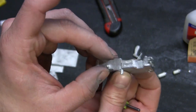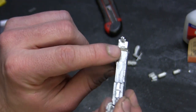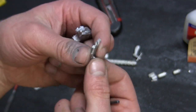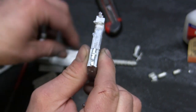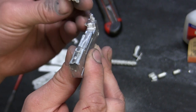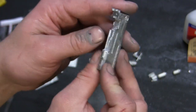You see, with the way the Armorpax kit is designed, because of the way it's molded, the hinge section here is plugged up with a little bit of metal. So this metal is going to have to be removed in order to get the feed tray cover to properly drop in place. You can see the indentation where it needs to go. And as for how much needs to be removed with the thickness, it's not really a whole lot. It's probably about a little over 1/16 of an inch, or maybe about 2 millimeters or so for my metric audience.